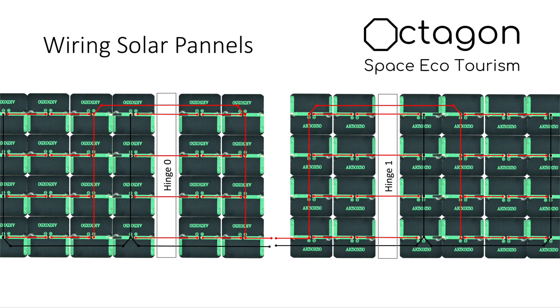The design of the actual solar panel tray — the box these solar cells will sit in — is going to be somewhat independent. I've chosen this design so that if you get shade over one area, having fewer things in series is better. The solar charger I have actually supports six volts, so we could step it up — time and experimentation will tell.